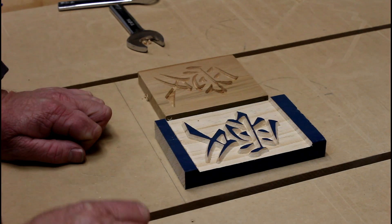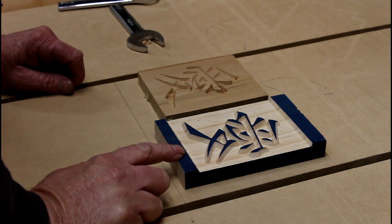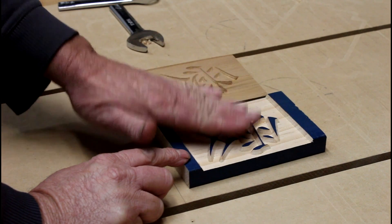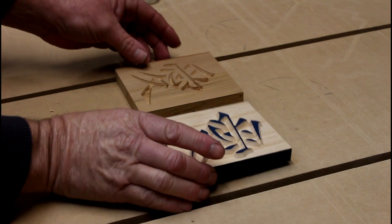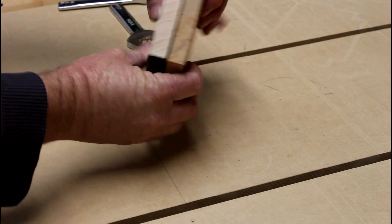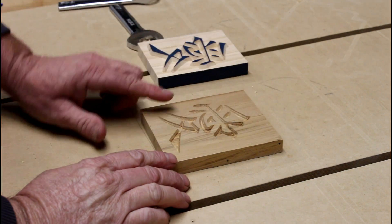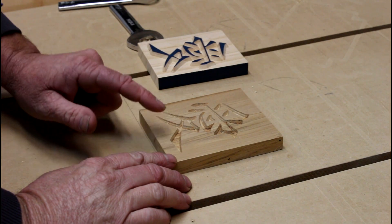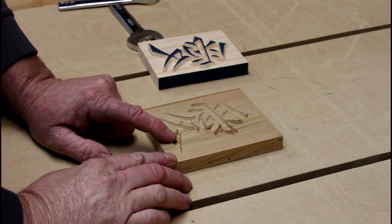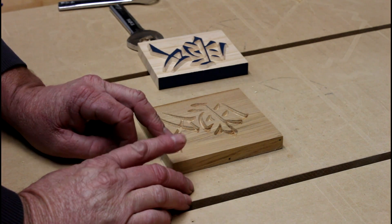Well, this is just typical — if I'd tried to accurately set those cutters it would never have worked, but since I wasn't trying they've come out perfect. I need to trim this piece so that when it's upturned it will fit with the other piece. Now that it's trimmed it will fit like so. Looking at this more closely: the female part is simply a standard V-carve with a flat area — I set the flat area to three millimeters, so the V-cutter went in and cut down to three millimeters and stopped.